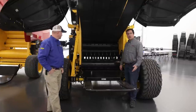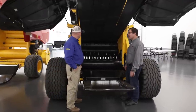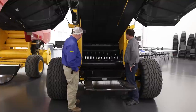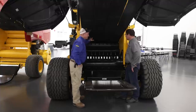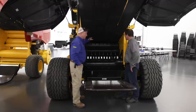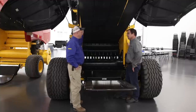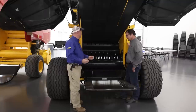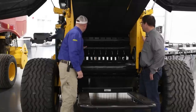As we made our way to the back of the baler, the first thing I noticed when we look inside is that we are definitely missing some parts we're used to seeing back here. We have the starter roll and the stationary roll, but we're missing the whole sledge frame assembly — the sledge frame is gone. We did that for one major reason: sledge frames have more moving parts, which means more wear and tear and more maintenance. Removing it increases the longevity of the baler.